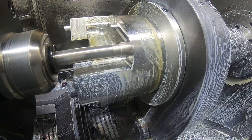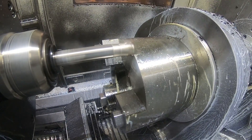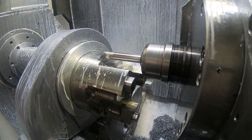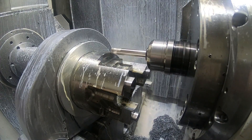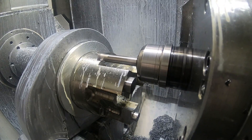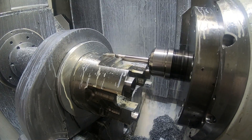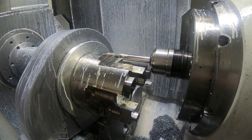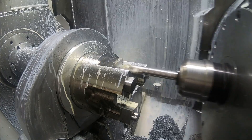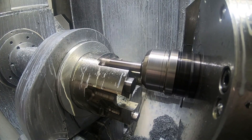You don't have to worry about — if you take deep depths of cut with a regular face mill, you have to be ready to stop it if an insert breaks, but you don't have that trouble with feed mills. On a 3-inch feed mill it'd probably be running 250 inches per minute feed rates. This tool is taking about 50 thousandths depth of cut and running at 60 inches per minute in this video, but I would typically run it faster than that without really having any problem.